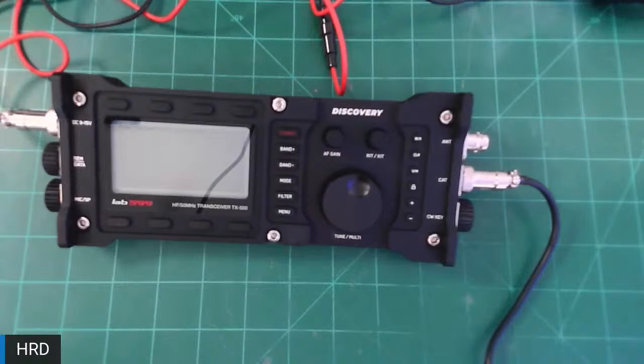So I have the COM port available. You can't see it on the computer again, but it's COM port 12 because I've already loaded those drivers, which they mentioned down here. And then it says to load the firmware file. So on the software that's update firmware, basically I'm going to click open and I'm going to be able to go and find wherever I downloaded that new firmware to, which for me is my desktop. And then I'm going to click the update button.